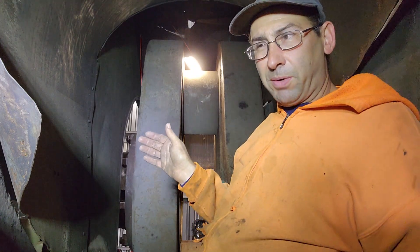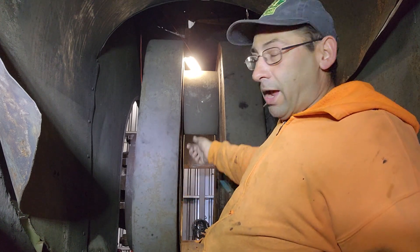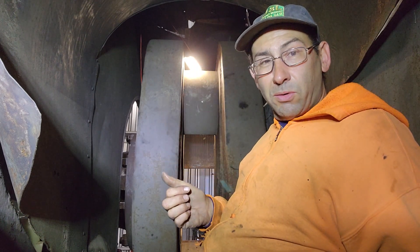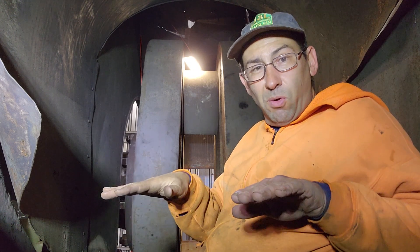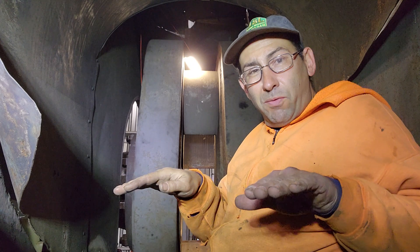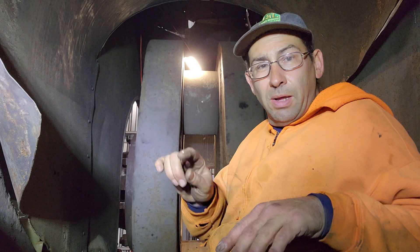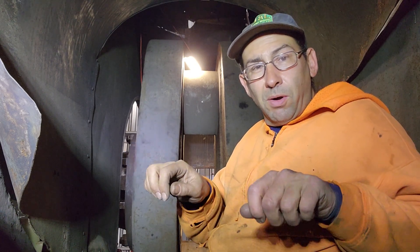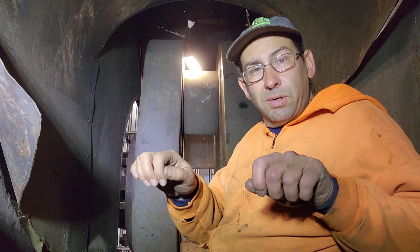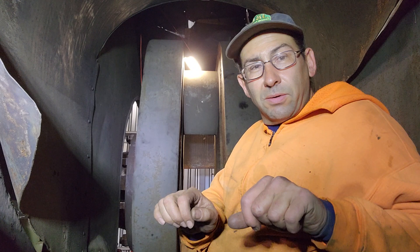It's kind of a tedious process. If it's off a little bit, that means you've got to jack up this 230,000-pound crankshaft and flywheel, get it up on rollers, barely move it a little bit, set it back down in the bearings, and then rotate it again. Did we get it? Maybe not, maybe so — went a little bit too far. Jack it up, get it back into position. Just keep doing that until you're satisfied that it's in alignment.